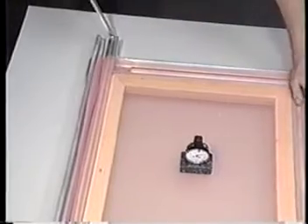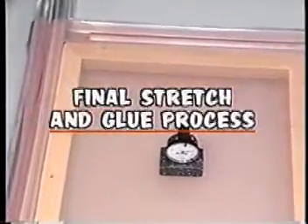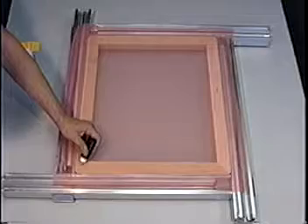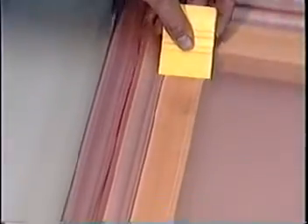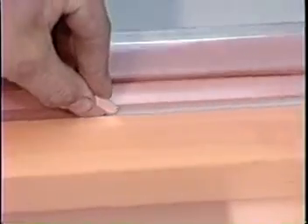Now that excessive corner tension has been eliminated, a second or final tensioning may be applied. A tension meter should be used to ensure proper and accurate tensioning. Apply screen adhesive from top of mesh to frame below. Spread glue out to cover the frame and spray activator in small sections. Cut out when adhesive cures.